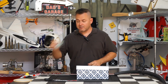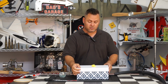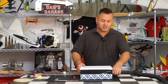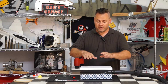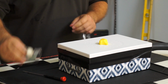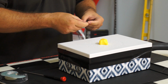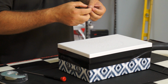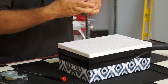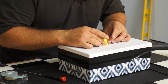We're going to use double-sided sticky tape to tape the mold down to the top, and then just go ahead and prep this with a little petroleum jelly, so that's our mold release on it. All right, so I have my box edges taped up. I got my vacuum cleaner hose poked right into the side and taped up as well. So all the airflow is going to be going straight down through these holes that we poked into it. Next, I'm going to take our 3D printed mold. I'm just going to use two-sided tape. And this is just going to stop it from shifting around as the vacuum is drawn over it.